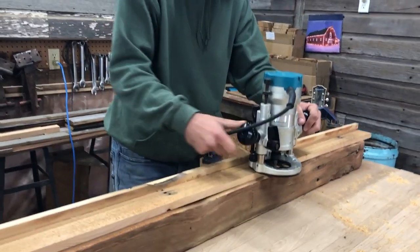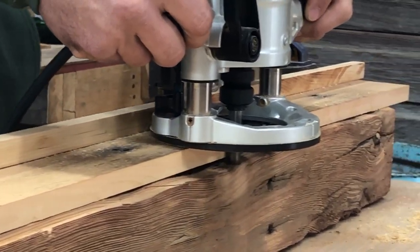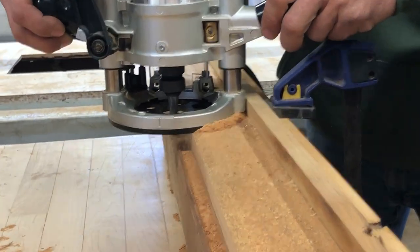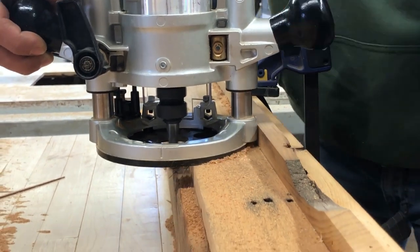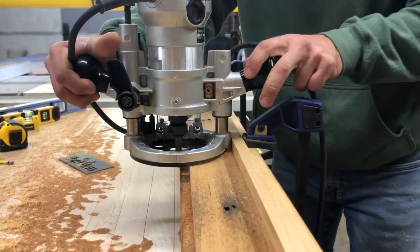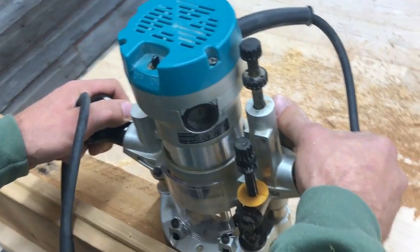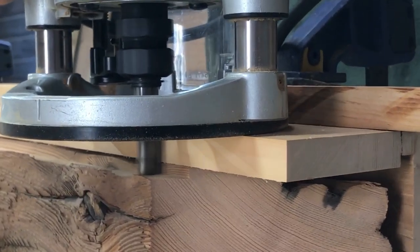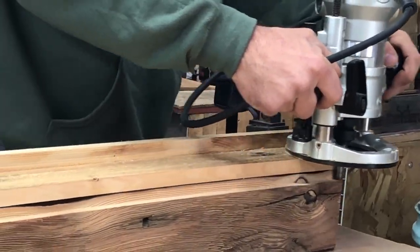This is intense right now. I had my hands on that router and was probably breathing heavy — I was definitely in tune — because you only get one shot. What I was pointing out there was the side of the router pulling out from the template a little bit, and you can see how we're busting off that little piece. I wasn't worried about tear-out — it actually cut nice and smooth. There are multiple passes; I took off about an eighth of an inch at a time and we just kept doing that over and over. That was the final cleanup pass.